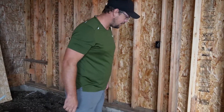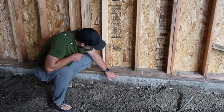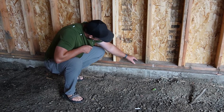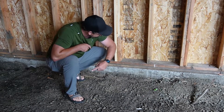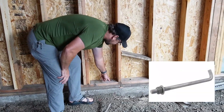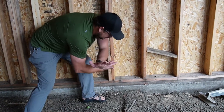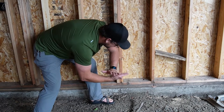The first part about framing a house starts with the foundation. The first board we put on is a two-by-six sill plate. It's pressure treated with sealer underneath so it does not rot — we don't put regular wood on concrete because it'll rot. We set the sill plate on the entire perimeter of the foundation, then we have anchor bolts about every four feet. That keeps the house from sliding back and forth — not for lift, but for lateral sliding.